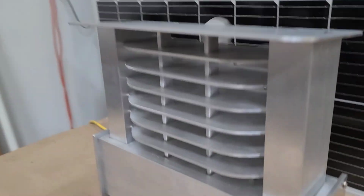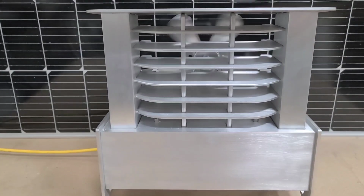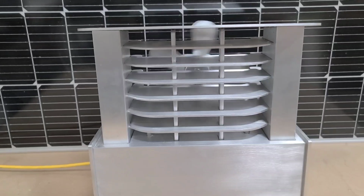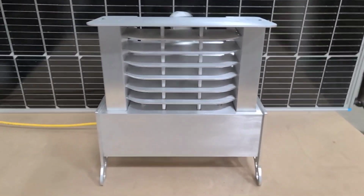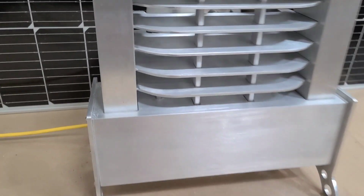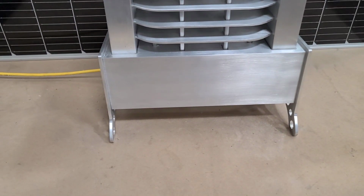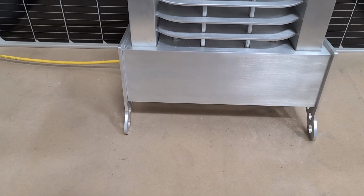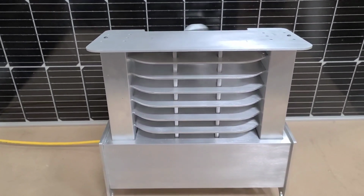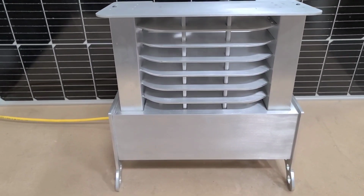But we've probably sped up by 50 to 100 RPMs just with that sitting on there. You know, that'll continue to climb. So am I happy with it? I may add that other heat exchanger in there. We're running at 52 watts right now, so that would bring it up to somewhere around 75, 80 watts, and it is producing meaningful heat right now.